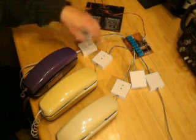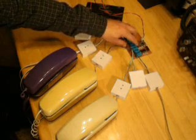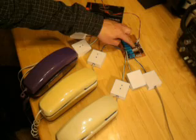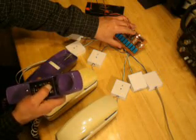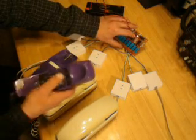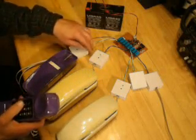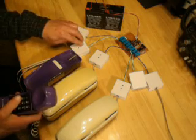On the circuit board, I've got a relay for each of the outputs, and all I'm doing is reversing the polarity of the line going out to the station to signal it. I'm using an 8870 DTMF, or touch-tone decoder chip, and a 74HC237, which is a simple logic gate — it's a 3-to-8 decoder, because the output of this is binary and I want individual outputs. I added some LEDs onto the board so you can see as I go through the stations. I can signal eight different stations just dialing on the touch-tone pad. When I push the button, the thing decodes the tone, reverses the polarity going to the station, and also disconnects it from the talk bus — that's how it signals and makes the sounder operate and lights the LED.